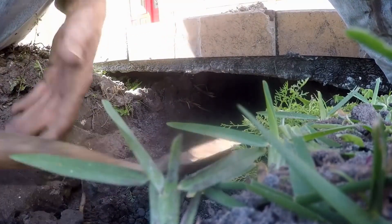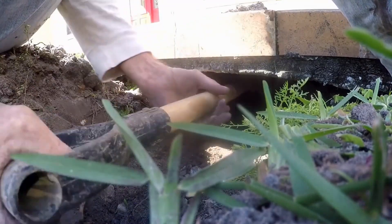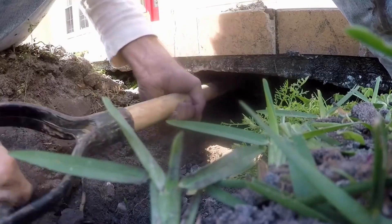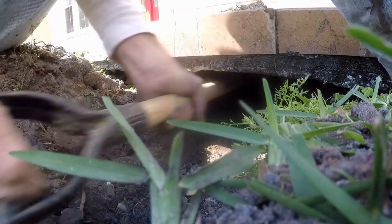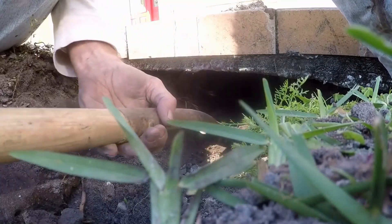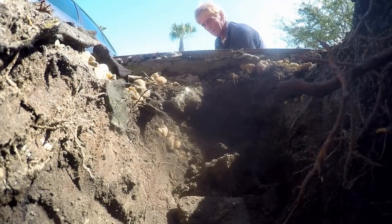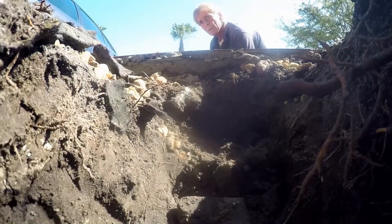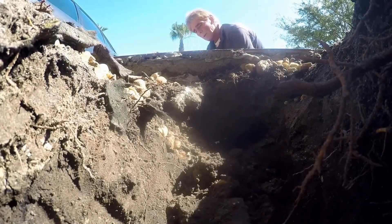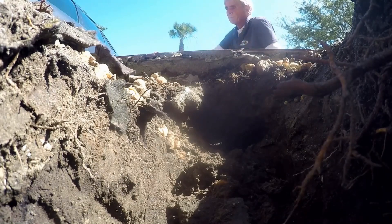Then we come down and we just pretty much clean out the soil that dropped down — put it off to the side. Within minutes, you're going to be through this walk. Scrape the top of the bottom of the sidewalk; sounds confusing, but I think you got it. Then we come back and lift that soil up from the bottom of the trench. This way we don't get a belly — it's a very clean and straight trench. I went from both sides, and now finishing it up — you can see that shovel just pops right through. Take a look at the trench; you'll notice there's no belly.